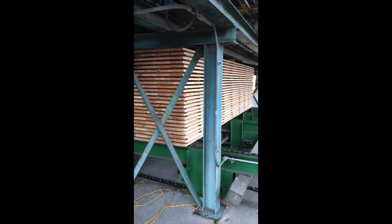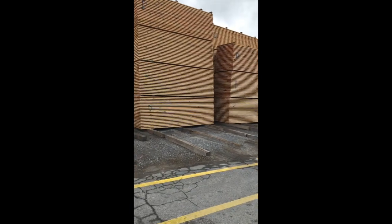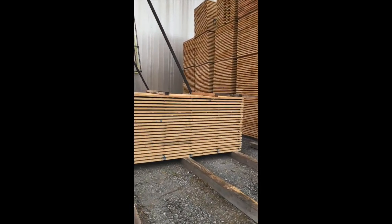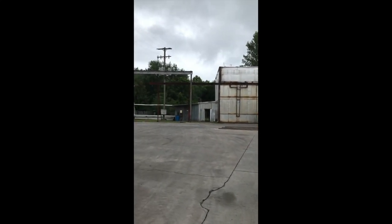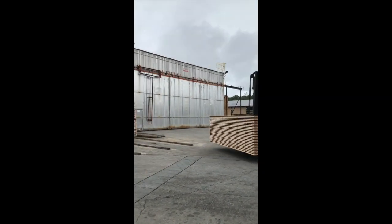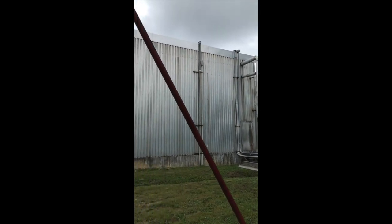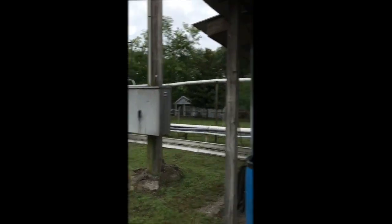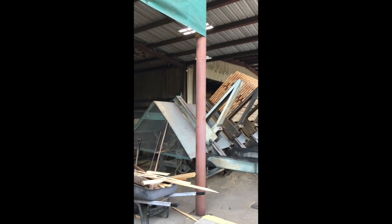After the sticks have been laid, it's ready to go to the staging yard to wait on the dryer to open. Each dryer holds about 100,000 board feet. It takes 60 hours to dry four-quarter southern yellow pine — which is really a one inch board — down to 12 percent moisture content, starting out around 60 percent, at about 180 degrees. After it exits the dryers, it's ready for the planer mill.